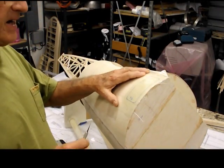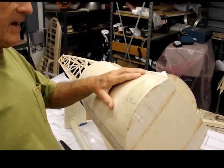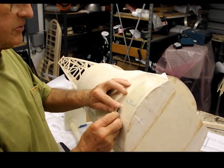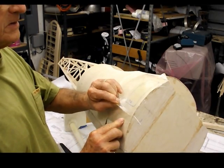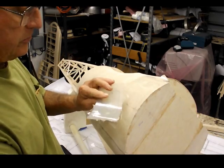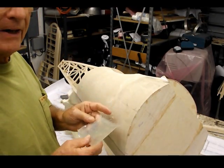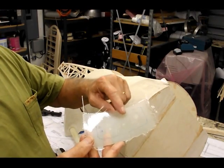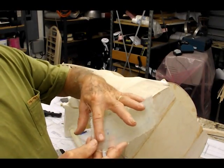You can see the packing tape on here — we've laid up our fiberglass on top and it's cured off. All we do is get this started, like so — bingo, pops off just that easily. So you can see packing tape is a very, very good release agent.